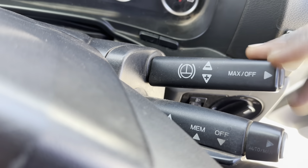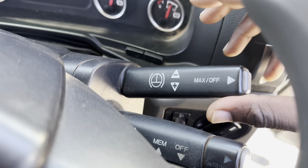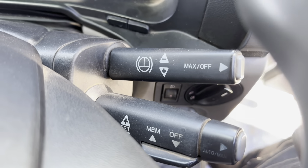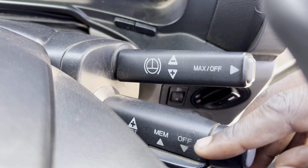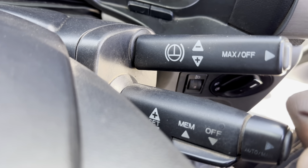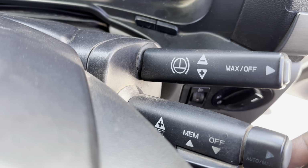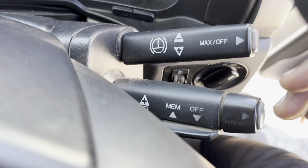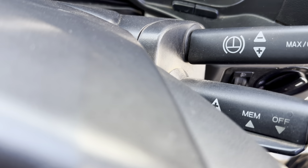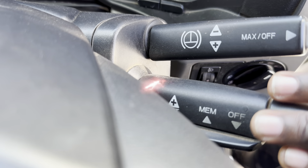the retarder. Or you can just do it like going upwards, you just do the opposite, ne? Then your gear here, and you know that when you press it here, you change it from automatic to manual, just like that, ne? But the thing that you can do here, when you are changing a gear, you tap it back to you. You tap it back to you, it's gonna say gear 1, gear 2, just like that. When you wanna do a change down, you just tap it back. So, just like that.